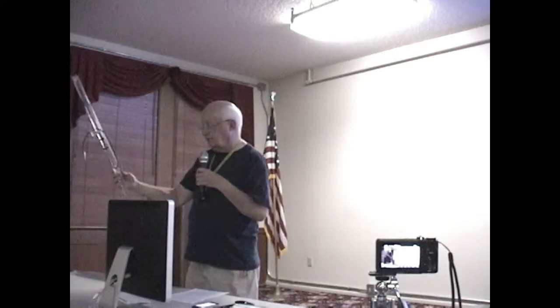As you know, I'm a two-meter weak signal guy, so I'm not really into three-element antennas. This one is made out of brass, and it's similar to the one that we're talking about here — it has a clear Lucite square boom. In any Yagi antenna, each element has to be resonant at the frequency, and the spacing and how it is made has a formula in fractions of the wavelength.